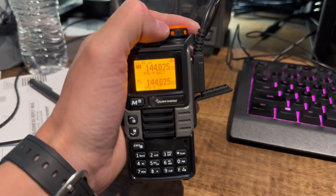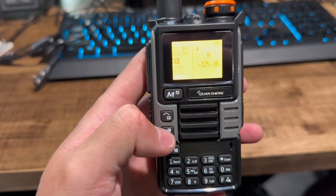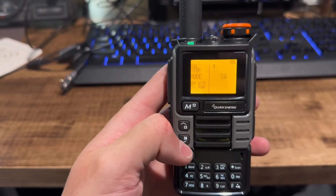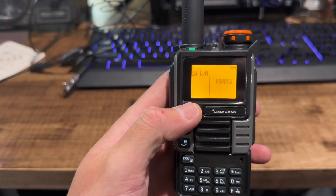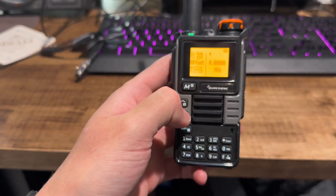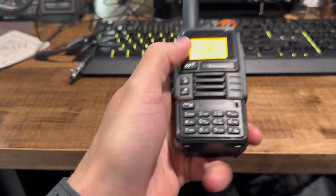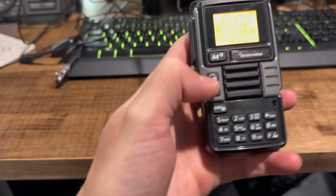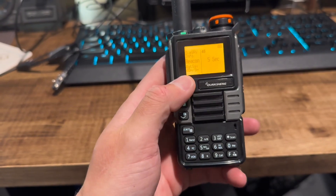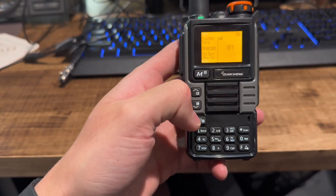It's done flashing — IJV 2.9.5, there you go. Let's go through the settings. To go to settings, hit the menu. First, turn squelch all the way off — we'll program those squelch buttons to be quick-access buttons on the left. Then go to mode and hit CW. Then go to narrow. Transmit power: high. And the first thing you want to do with all these radios is turn beacon off. It's really annoying when you put that firmware on — it'll go to that beacon right away. The beacon menu is menu 45. Get that beacon off and now you're good to go.